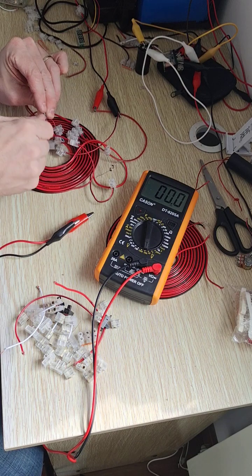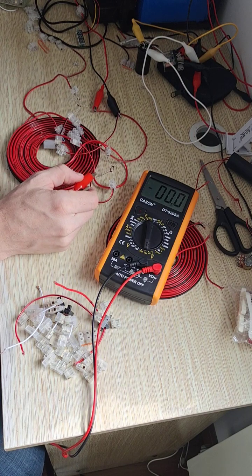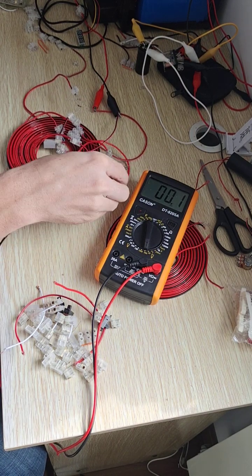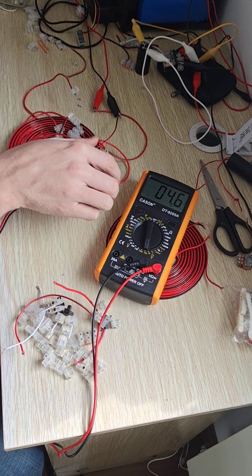What do you think is going to happen? What do you think the voltage of this bottom coil is going to be now? Let's just double check the voltage of the top coil, which was 70, but because I flipped the bottom coil around, it might have an effect on the output here as well. Now the top coil has gone to 4.5 volts. How amazing is that? Just by flipping the bottom coil around, the top coil has gone from 70 volts to 4.5 volts.